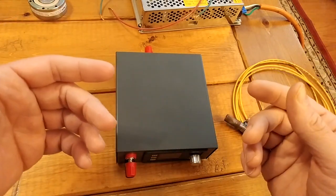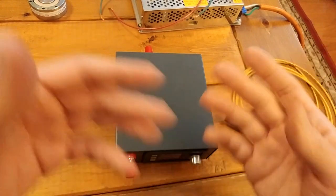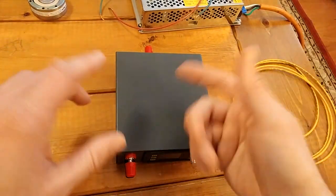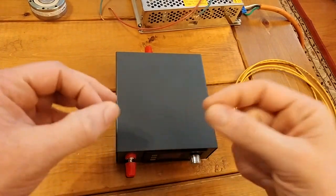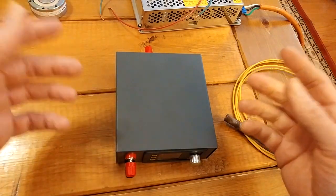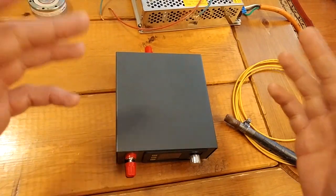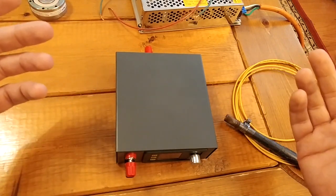EDM can give you very fine surface finishes and you can do some really intricate cuts because your cutter — it's not like a spinning end mill where you have deflection and tool width to worry about. It's just an electrode, so a bent piece of wire can be your cutter. You can get weird undercuts in funny shapes, go really tight in corners because your wire can be really thin. The downside with EDM is the power supply — kilo-amps at kilovolts at kilohertz — it's also very expensive, thousands and thousands of dollars, well beyond the budget of the typical home shop.